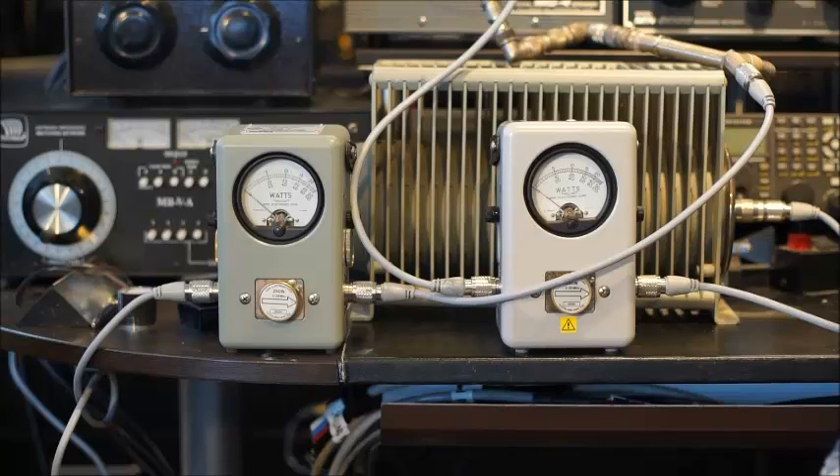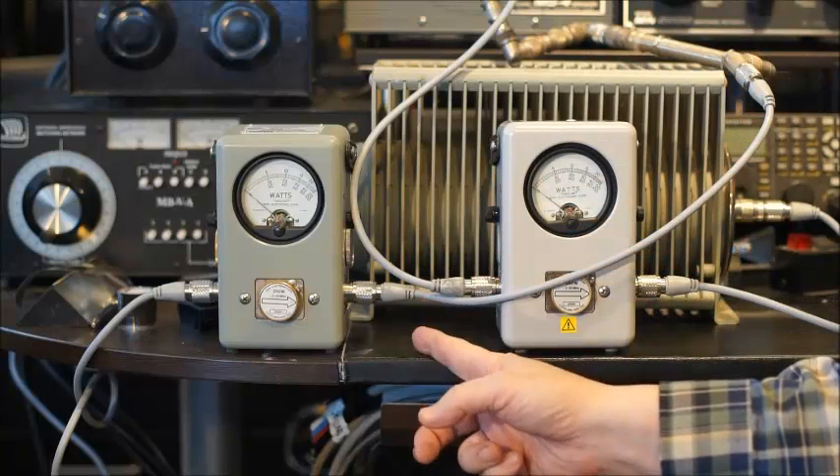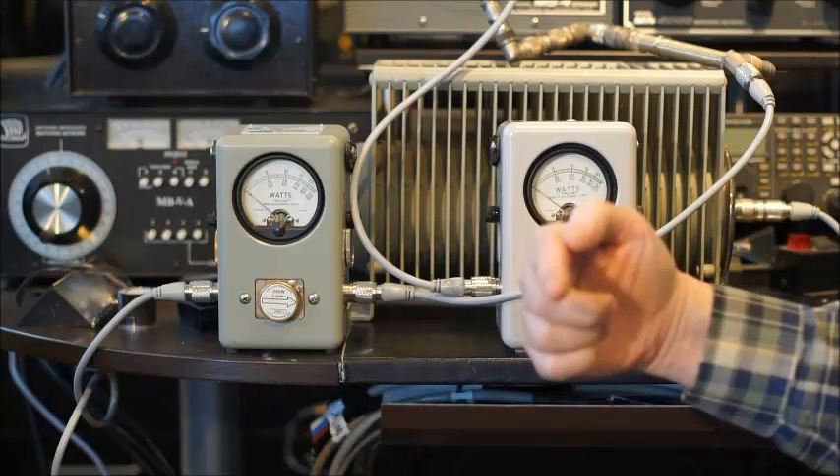So that was our test of coax connectors. In a subsequent video I'm going to do the same test, but instead of connectors we're going to put a length of coax there — that's where it'll really get interesting. This is actually my second time ending this video; a couple minutes in, the camera shut off because it got too hot. What we learned is that a lot of coax connectors don't really create a lot of loss. Coax does, and we'll talk about that later. Don't worry about coax connectors — if properly installed, it's negligible, if not zero, at 14 megahertz. It's more likely an issue at two meters and certainly at 432 MHz and up. At those frequencies, connectors become really, really important.